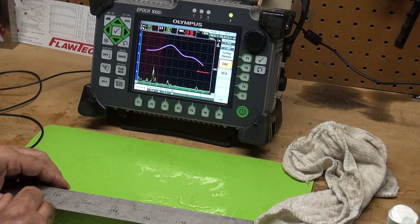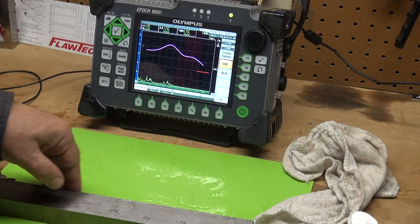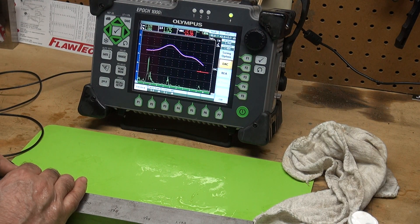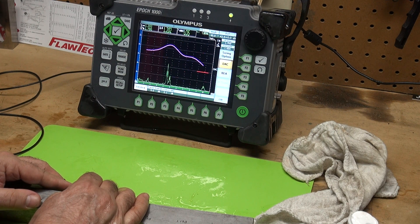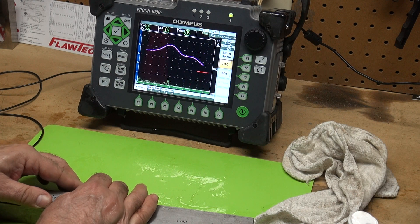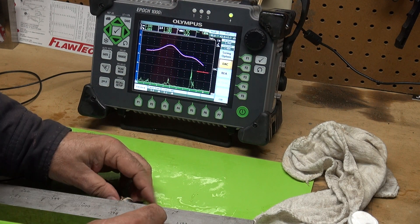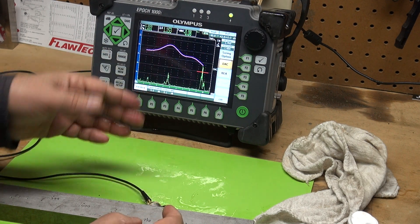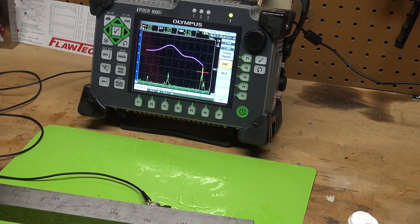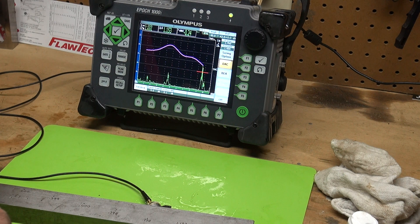In the near field the readings are not completely reliable. Let me put some couplant on here, because when you squeeze it out it shows the effect that your touch has on the signal. Near field: 0.2 deep, 0.4 deep are in the near field; 0.6 deep we're still in the near field, but at 0.8 we start getting into the far field and you see how it attenuates and curves down. The pressure of the transducer and how you squeeze the couplant out has an impact on the signal amplitude. That is just a quick overview of the quick DAC we can set with distance amplitude correction and time varied gain.